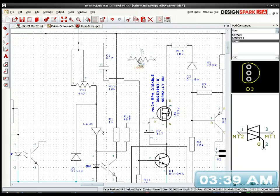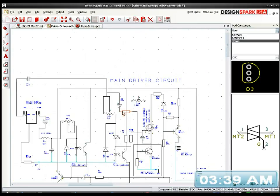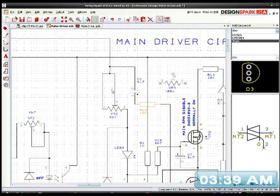And what I'll do is I'll stick that on the other side of this resistor, on this other side of this 10K, because this capacitor here is the plus side, so it would only have to tap onto this leg here to send a bit of bias this way, but the bias won't go the other way because of the capacitor being there. The DC won't get through that way. And this is the AC side anyway. This side is AC, and it's going to be alternating. This side is the DC side, but it's going to receive an AC signal anyway.